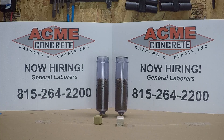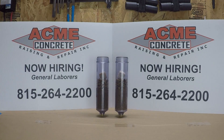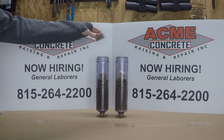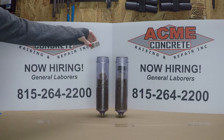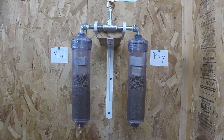We have here two water filter housings filled with sand and pea gravel. We'll add the cube of polyurethane to one housing and the cube of mudjacking mud to the other. We'll test the water erosion effects on both materials at the same time under the same conditions by adding water. Since leveling materials are injected underneath concrete, we've placed a piece of concrete on top of each cube to simulate a realistic environment. The filter housings have been connected to a common water supply. Now we'll turn on the water and film the effects — switching to time-lapse mode to speed things up.